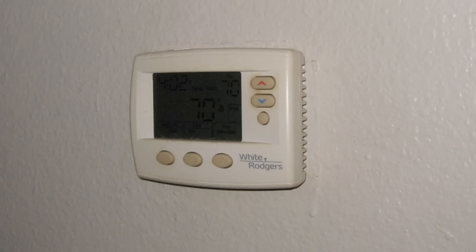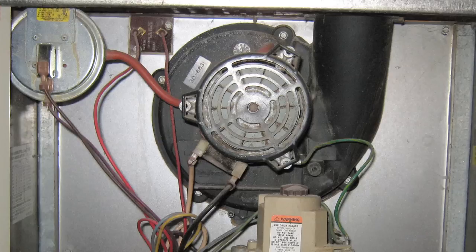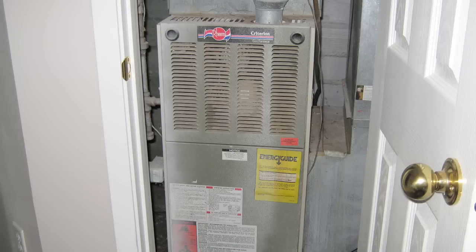This was me when I came home from work to a cold house. First, the diagnostic. The thermostat is set for 68 but the ambient air temperature is 65. Periodically I could hear the combustion motor kicking in — a familiar sound that usually meant heat was on the way — but this time when the main blower kicked on it was cold air.